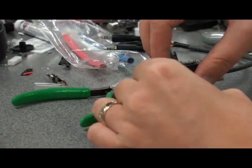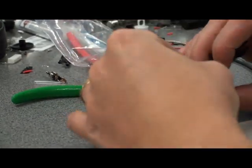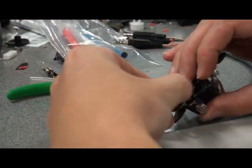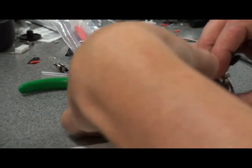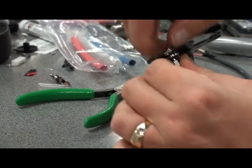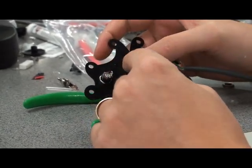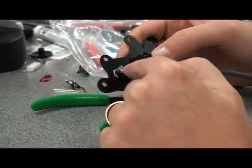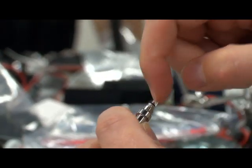Then we need to get the power connector. Depending on what kind of connector you get, you have to check which one is ground, which one is plus and minus. And the easiest way to do that is just connect the power supply of the adapter and see how the current is running through it. So we will not tighten this too much for the time being, but generally we'll then run the plus from here to here, and then from there we'll run 3 pluses for each of the power connectors. We'll do the same thing with minus, so minus and plus in the center.